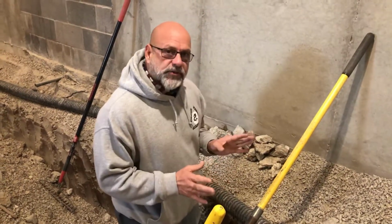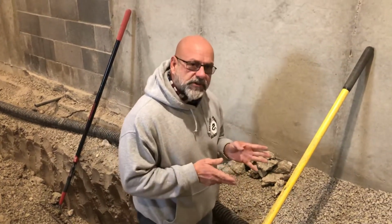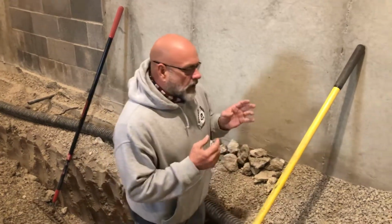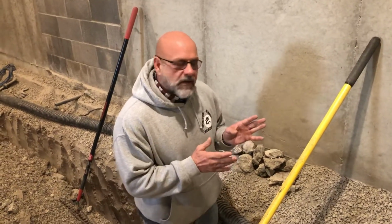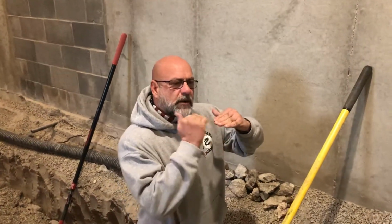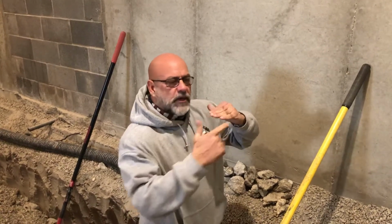The footing is low strength concrete. I deal with footings every day. The structural engineers at Norton and Schmidt or anywhere else, they don't look at them every day. They don't work with them every day. I do. We do everything gentle to those footings. We don't want to drill holes in them, because where you drill that hole is going to become a crack. And that footing is now separated other than 2 runs of rebar.